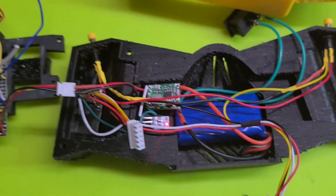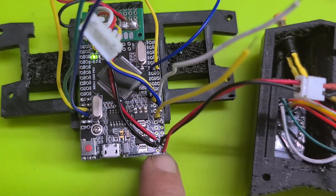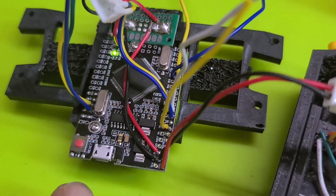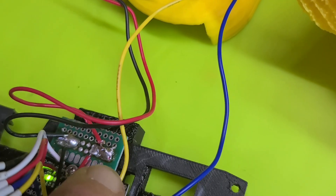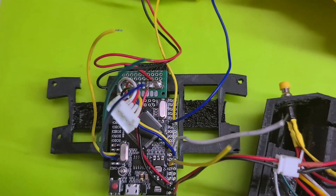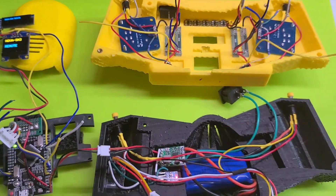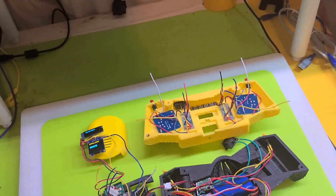We'll get away with a couple of buttons sharing ground and power. These connections I'm making all direct with no pins because we really don't have the room — I explained that in my previous video. We also have that small chip of PCB that I'm going to use as a ground and 5-volt plane. Making good use of the PS2 cover for Nova since that's on its way out.